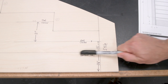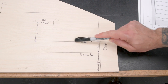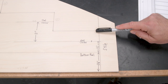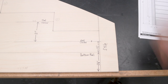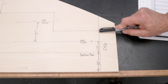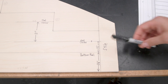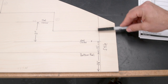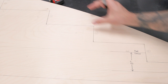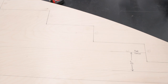In my example I have a two and a half inch bottom rail. From the Rockler drawing I know I go one and a half inches to the first louver center point, and one and a half inches to the top rail. My structure has a bunch of top rails since the arch creates a stair-step pattern — each step represents a single segment that will be glued together to make up the rail. With all of this worked out, we can dive into our pile of alder.